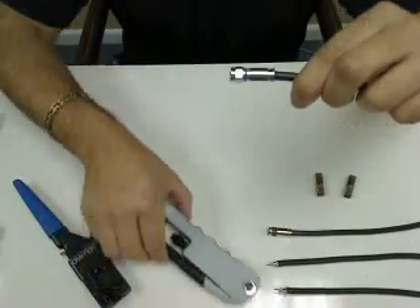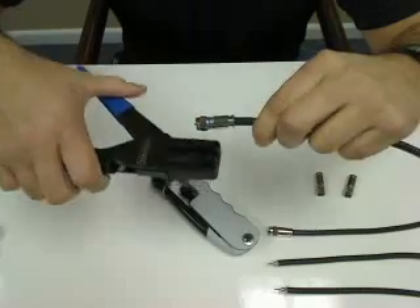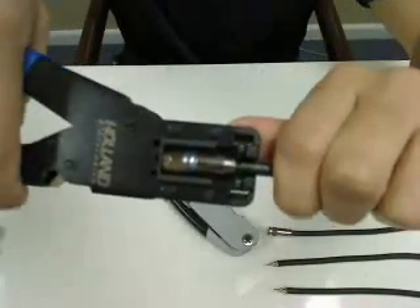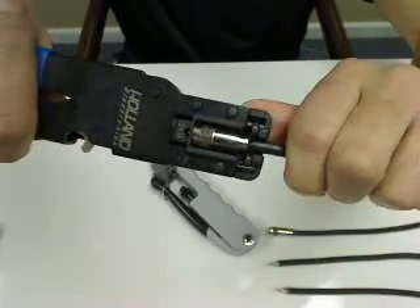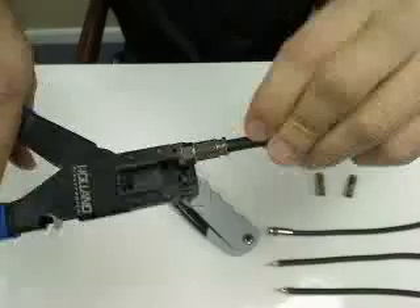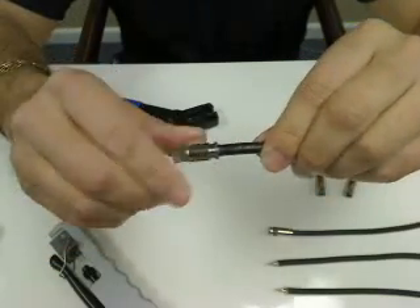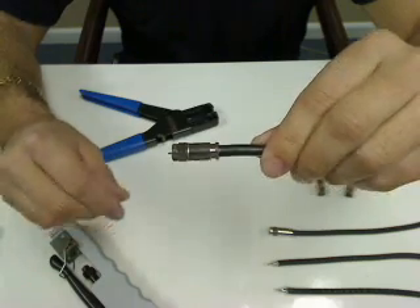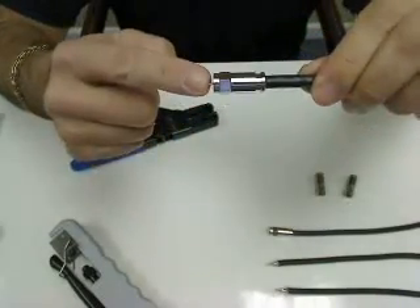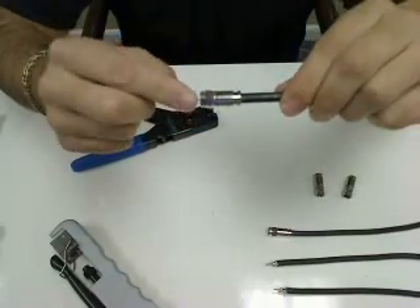Your final stage is to compress it by using one of these tools. There are many different compression tools. I'm simply going to use what we call a ratchet type compression tool. We insert the compression connector and coax into the chamber. We compress. You can see it's compressed — industry standard is 21 millimeters. We remove the connector and coax from the tool. I like to give it just a slight tug just to make sure we have a great compression. And here we have a very well compressed connector sealed around the coax cable, with exposed center conductor just beyond the lip for great connectivity on the back of any cable box, splitter, or satellite box.